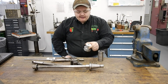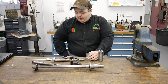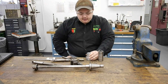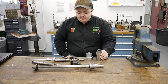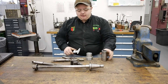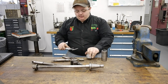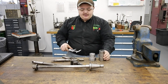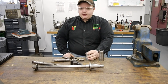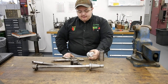I don't have an 1/8-inch broach for this right now, because most of the 7/8 tooling takes 1/8-inch keyways, but I may have one in another shop I could bring over. As for the length of this bushing, the overarm support is roughly 2 inches long where the bushing end is, and this piece is just over 2-1/2 inches, so I'm not too concerned about it distributing the load fine. At the end, I'll leave about 5 thou extra and then tool post grind that to size so we can get a nice bearing surface and it'll ride in the bushing really smooth.